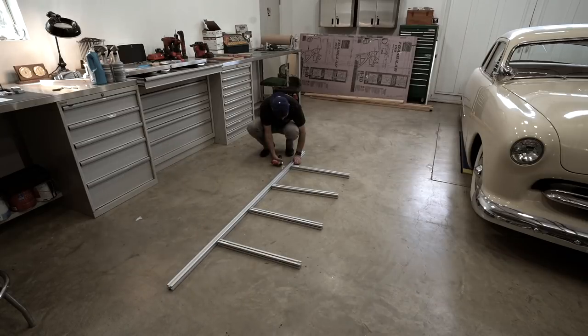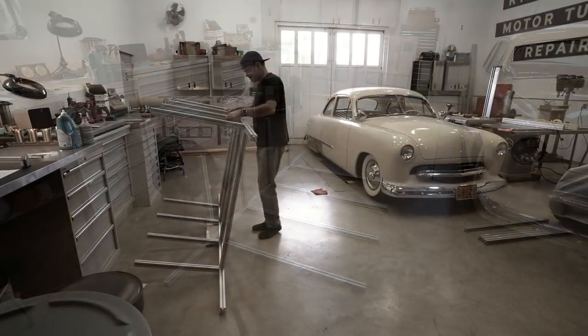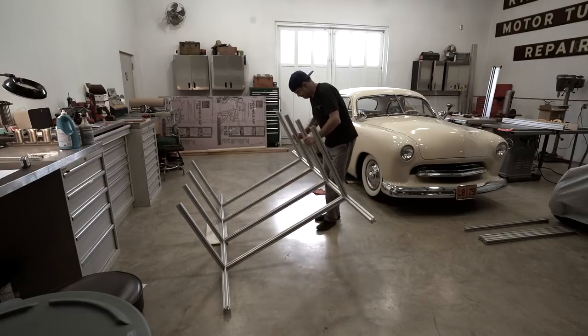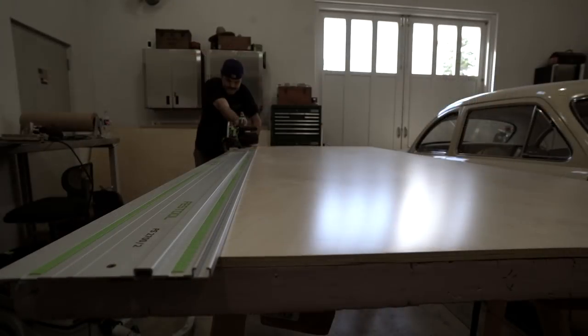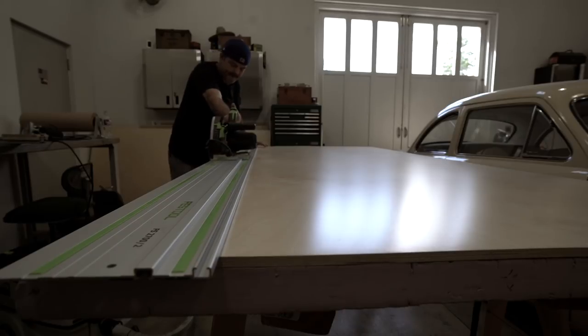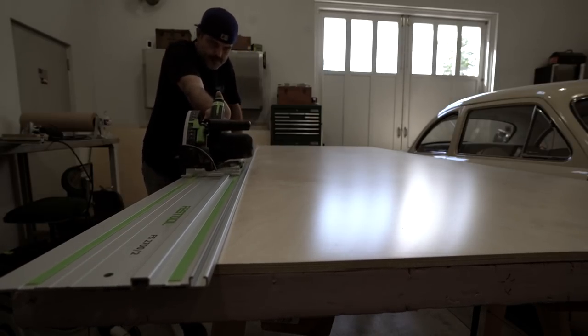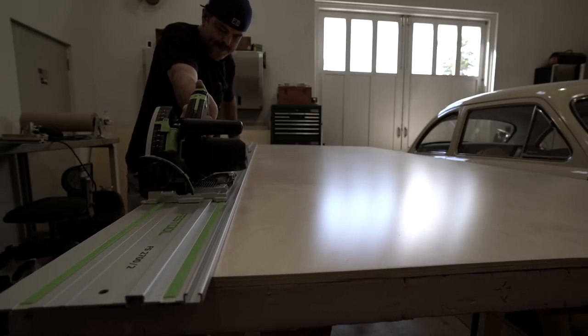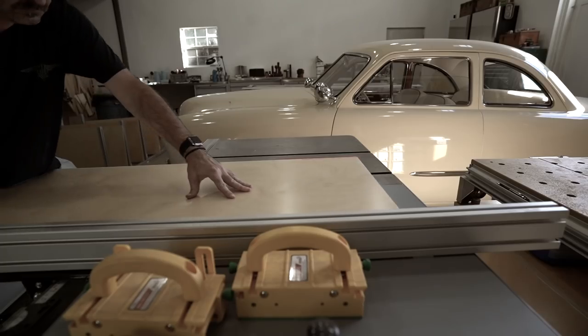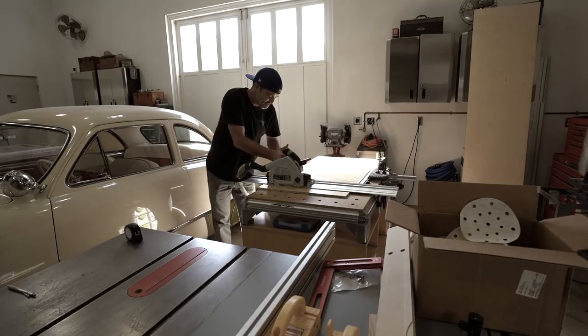Because I'm using captured joints, I had to be pretty specific with the order in which I assembled. I started with the side, added the bottom supports, and then bolted on the other side. With the basic substructure of the bench done, I could move on to the dividers. I opted to use 12mm pre-finished Baltic birch. I cut everything to manageable sizes with my track saw first, and then cut each divider to its final size using the table saw for rips and the MFT for cross cuts.